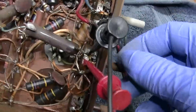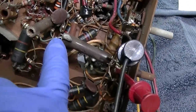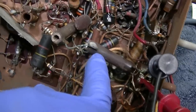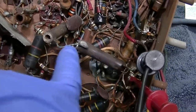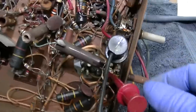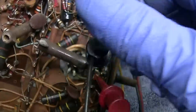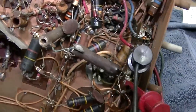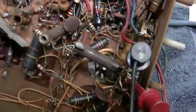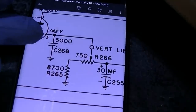It's just corroded leads. So let's see, we got these two resistors here that have obviously been replaced, because I don't know why you need two. What are these 15 watt resistors with a half watt pot or a 1 watt pot? Yeah, this is probably all corroded. So let me try and measure these resistors. Well, actually, it's not true, Warren.